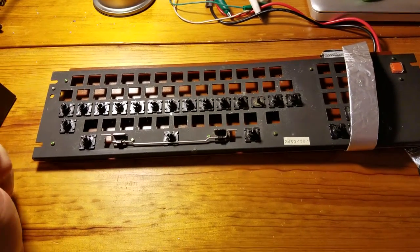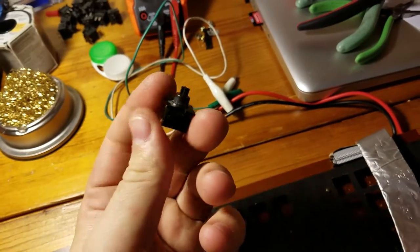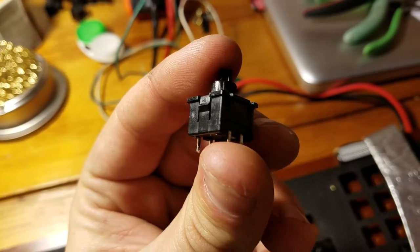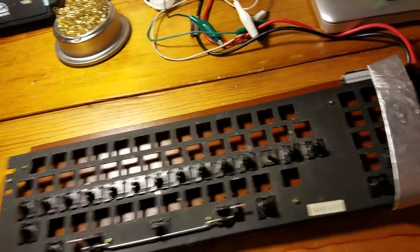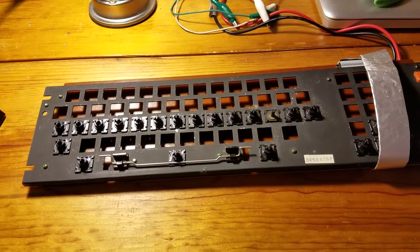As you all know, or if you're familiar with the TRS series, they have these really dumb, poorly engineered buttons. They're rubber dome switches on the inside, and the carbon starts wearing off the little touch pads. It gets all cloudy, you get extremely high resistances, and your buttons stop working.